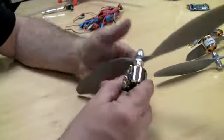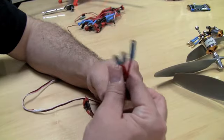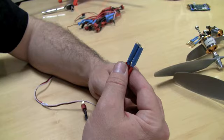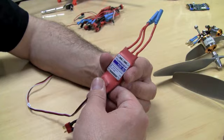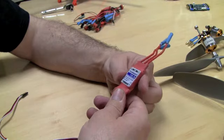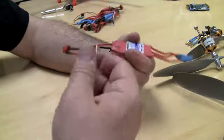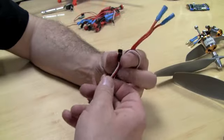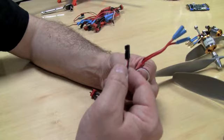The power system is the motor, and then we have to have an electronic speed controller. It's got three mating wires with female bullet connectors. These are Turnigy Plus 25-amp ESCs — electronic speed controls. You want to make sure you get one that can handle greater than 50 Hz pulse width modulation input. This is where the PWM signal comes into the controller. There's a typical three-pin servo connector — signal, power, ground — and that connects to the Hoverfly Pro board.